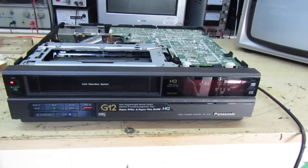I'm just going to give the area behind the vacuum fluorescent display a little clean, and also the infrared sensor where it comes in. I've popped two screws in to hold the front of the carriage in as well. So there we go - it's plugged in, test cassette in. Play first - the guides are locked in the V-blocks, we have take-up. Press stop - that's winding the cassette back in, so that's okay. Fast forward - yeah that's working. Stop, rewind - that's working. So I think it's safe now to connect a telly to this and put a tape in.